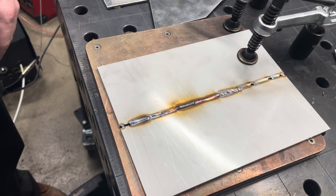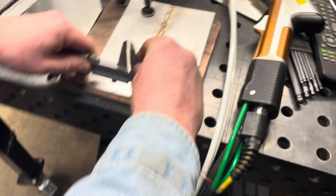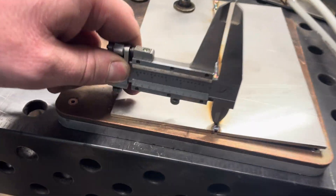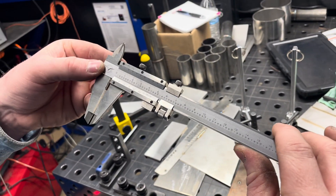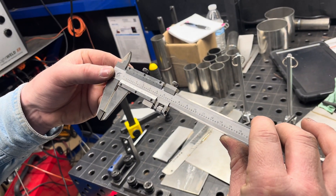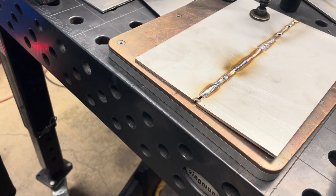That's filling about — let's measure that gap here. I'm sure it shrunk down a little bit, but that's filling about a 90-thousandths gap there, which is pretty good with 0.045 wires. That's just about what it should do.